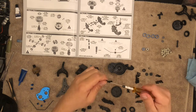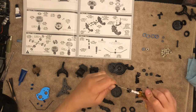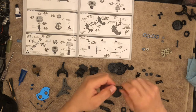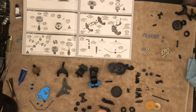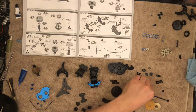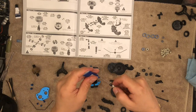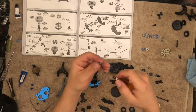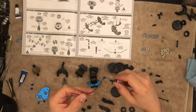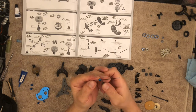So we're going to start getting this thing going. I'm going to get this a little closer — that looks about right. There we go, we have those two links. Now we're going to need one of these set screws and this little depressor. A little bit of thread lock, and now this collar. I'm going to bring the sway bar in and make sure it's about halfway. The recommendation is to measure; I'm just going to eyeball it for now.